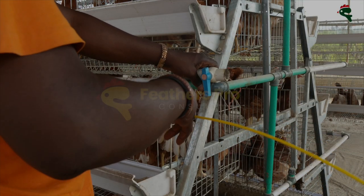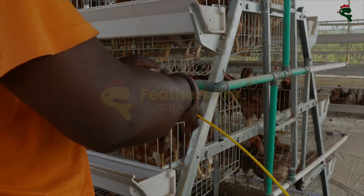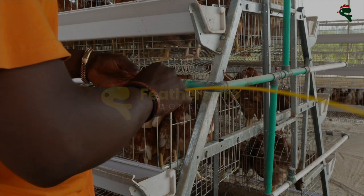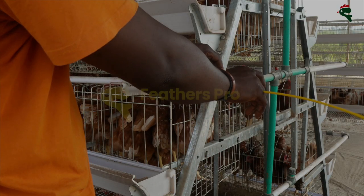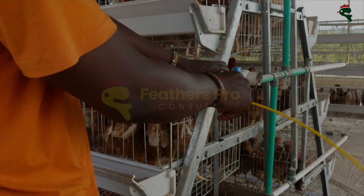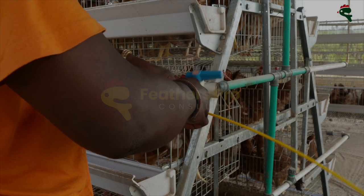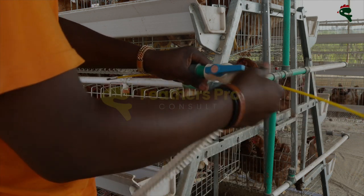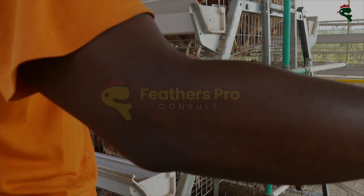You can come in the morning and be done in less than 30 minutes — it's really easy. Always remember: put in the line without the brush first, otherwise you won't be able to push it through. Then from the other end, screw in the brush and start to pull out. It's during the pulling out that you actually do the main cleaning job. So it's that easy.